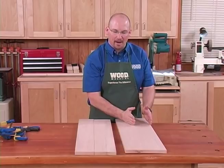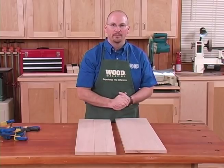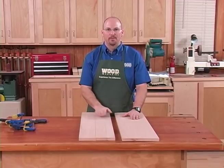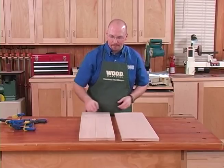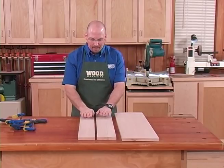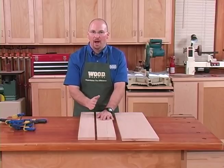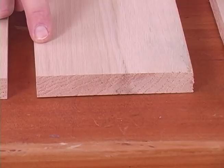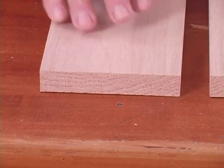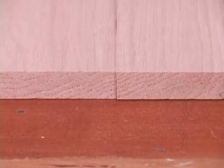We need to break this down into multiple parts and then bring it back together to flatten it out. These two planks came from the same board and had the same twist, but I've ripped each one in half. By reducing the width of the parts, I've removed a lot of the curve — in fact, almost all the twist. There's very little twist remaining and this one lays almost perfectly flat. But when I bring them together, the edges are no longer parallel.